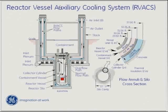That's the sort of thing we as nuclear engineers need to communicate to the public about transparent safety and the ruggedness of this design. It turns out those passive safety designs got picked up by the light water reactor community with the Generation III reactors. So it was really the fast reactor engineers who led the way on passive safety, which the light water reactor community then started adopting.